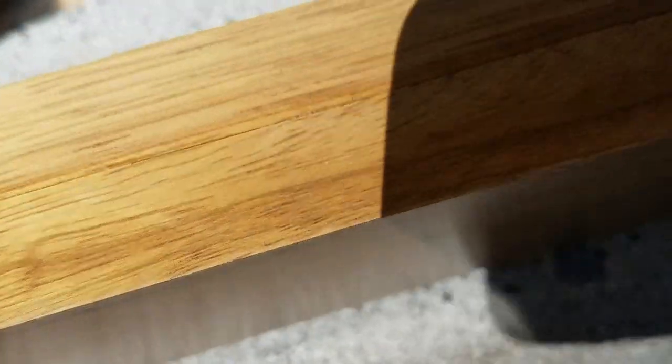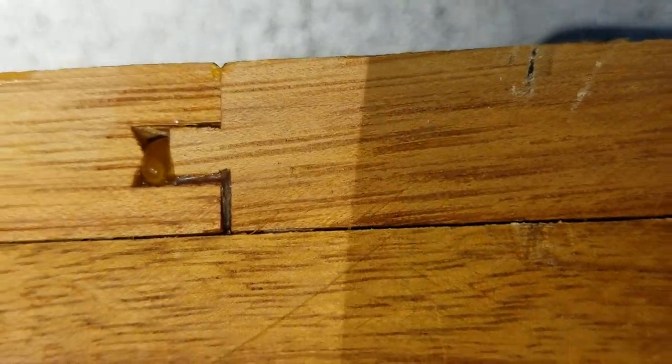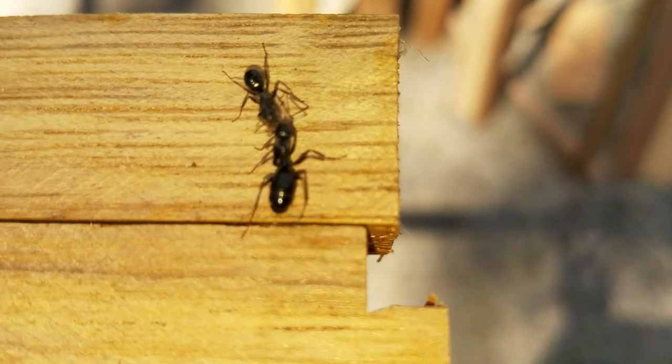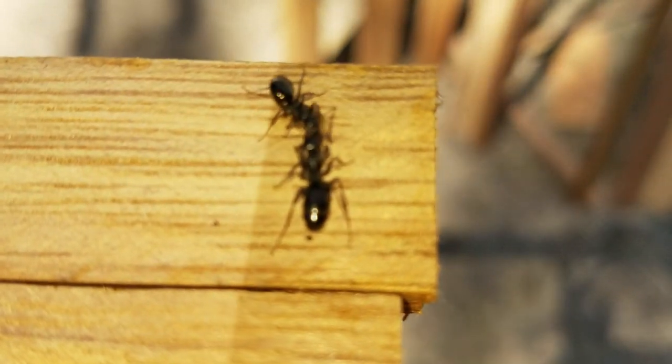You can see our glue joint is nice and tight on everything here. We will have a couple of tongue and groove joints there that we'll fill with some putty. I'm going to hit the top of this with the planer here to flatten it out.